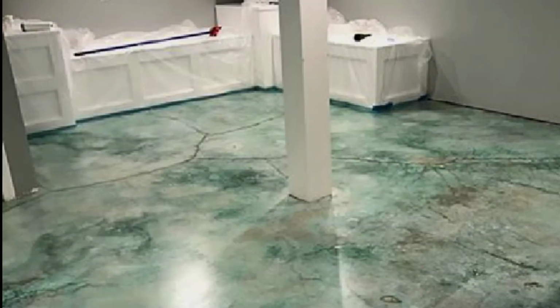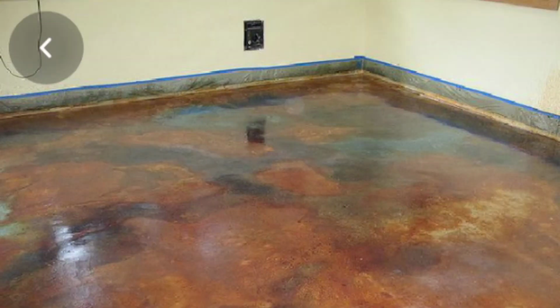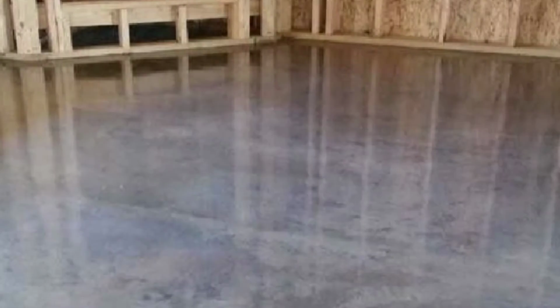The second question is, is metallic floor slippery? Well, to give a clear answer to that, just think of how slippery your regular concrete floor can be when it's wet. I use this comparison example most of the time for easy clarification because your regular concrete floor and metallic floor behave the same way when they are wet. So, there's nothing to worry about. It can be well managed.